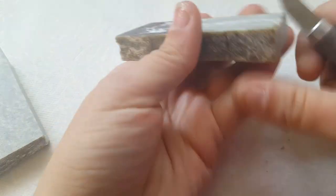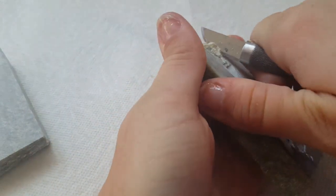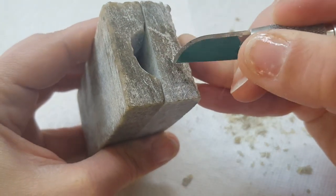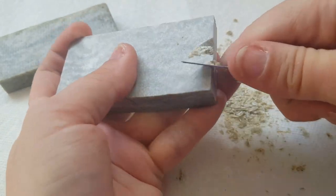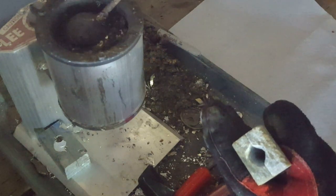When you are done carving out your design, you need to cut a sprue for the metal to pour into the brooch cavity. I'm cutting with a curved precision knife blade, which shows just how soft the stone is — I can remove a ton of material in a short amount of time. After carving out one half of the sprue on the front mold, I can use the end of it to mark out the placement for the sprue on the back half of the mold. At this point I should probably recommend wearing some form of face mask or eye protection.